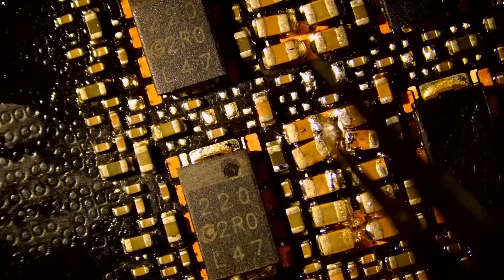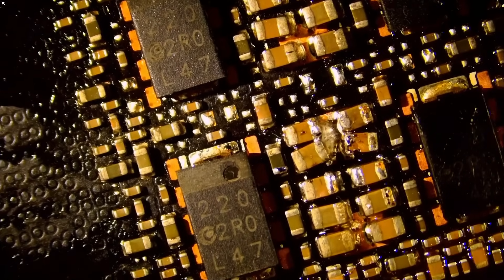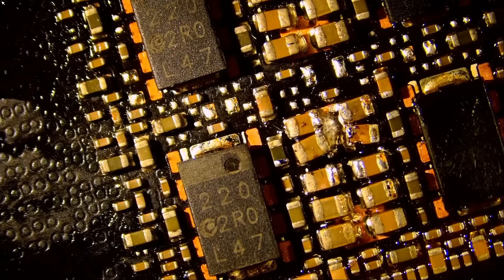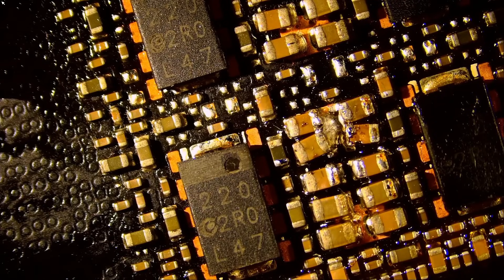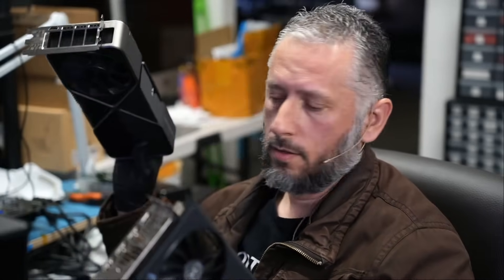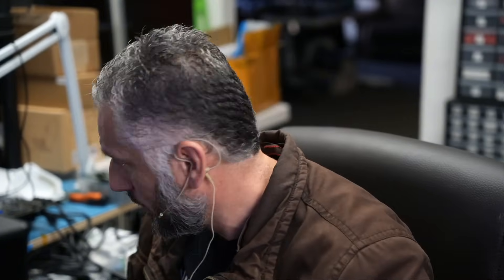So we're done. Will that card work? I don't know. I was surprised the card would not work because of one missing cap connecting in parallel, but maybe because the other one was not making a connection, it created instability in the card. Maybe. I have two more cards I need to test — one of them is this one here and the other one is this one here. I'm going to put them on the side — I have three video cards on my bench that we need to fix today, expedited.